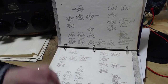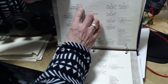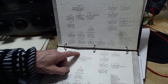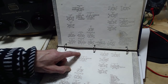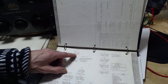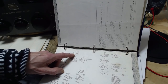Let's just look at another version of this. 390, 980. And this version of the radio, it's 0 and 390. No, it's 0 volts. Every one of these is showing some kind of resistance in here. This is tube 7, pin 1, 115,000. Pin 7, 0.